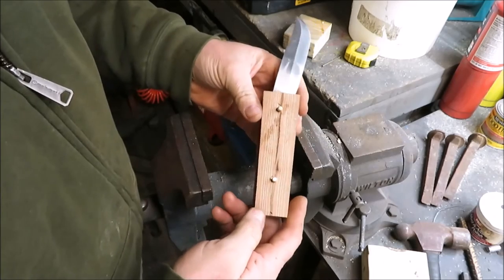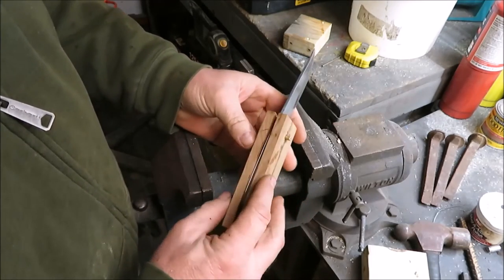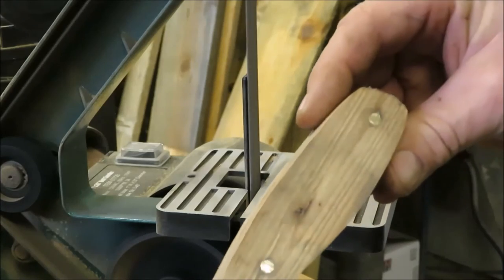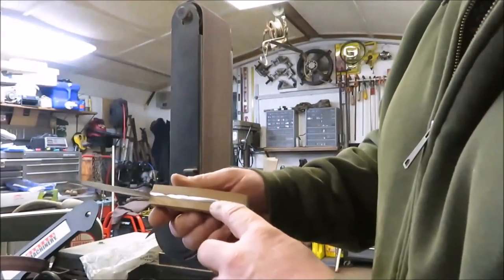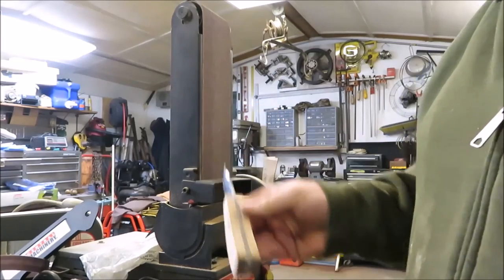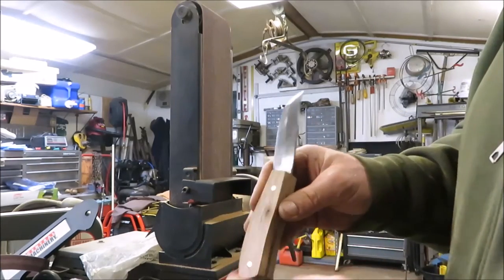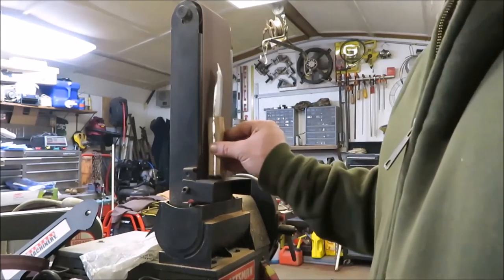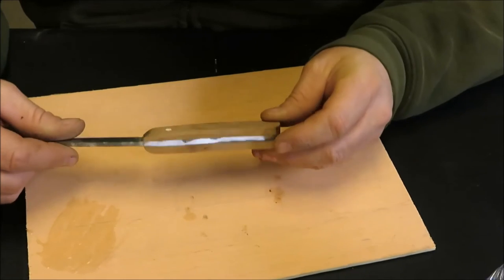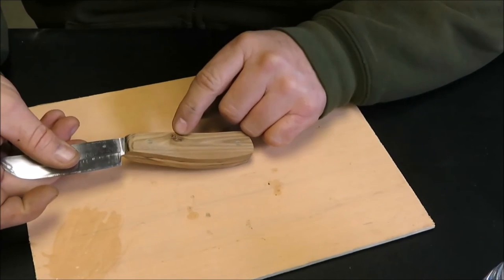It's been 24 hours and we got us a handle I think. We're going to take it to the grinder and start grinding all the wood down and these pegs - it's taking shape. We ground all the way around the edge to where we got to the metal. Now I'm going to take it on the sander and sand it down like this because I think it's just a bit too thick. I started sanding on one side and got one side smaller than the other right now, but I'm going to start on this side and try to get it down a little thinner. That seam that went through the middle actually sanded out of there - I thought it was going to be exposed, but we do have a nice little knot right here that will be exposed.